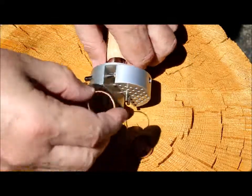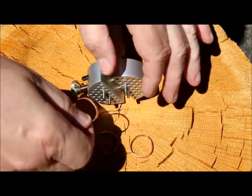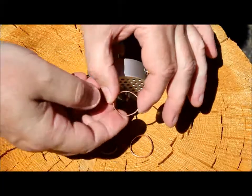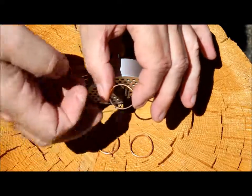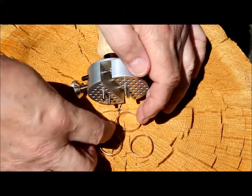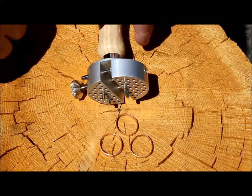So once you have deburred it, you really want to clean it, at least inside. The outside can wait, but the inside you need to clean, because once you have sharp corners, those corners are going to be difficult to get into. And thirdly, you need to anneal it. Now this is an M-type pipe, which is the thinnest wall pipe available commercially, and even that needs annealing to allow for the shape stretching to be problem free, so you don't develop cracks and bends where you don't want them. Again, I'm sure you know how to anneal copper. It's a fairly common process.